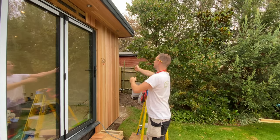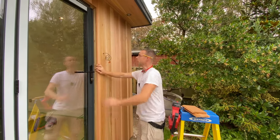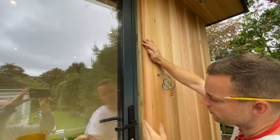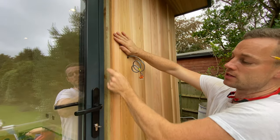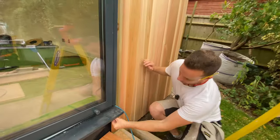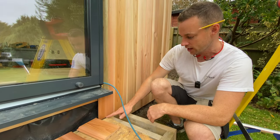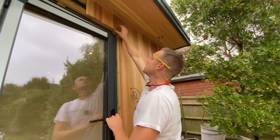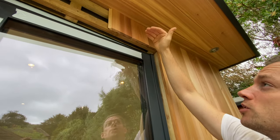We've got the first few lengths up, worked our way toward the door aperture, and we've cut a hole for our up-and-down lighter and fed the cable through. We've done a little cut here just around the batten — this doesn't have to be perfectly in line because you're going to have a 38mm trim covering your reveal. More important is cutting the bottom of the sill neatly. We've got our step here and the decking will cover those lines, so leave a little air gap — it's nice to let air run under the building.